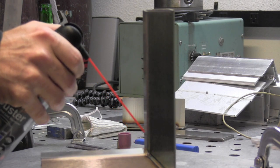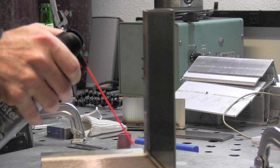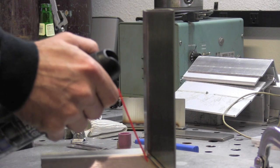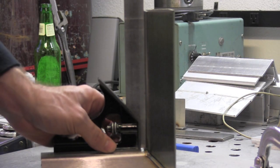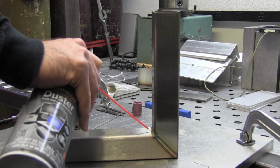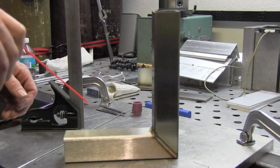Roy is using a little can of dust buster compressed air that you would use on a computer keyboard. Localized cooling on stainless steel does not hurt it metallurgically at all — it's not like dunking it in a bucket of water when it's red hot, just localized cooling a little bit. It's just a trick of the trade to help pull it over. If it still needs to come more, you can turn the can over and get a little cold shot with the liquid, and that really pulls it.